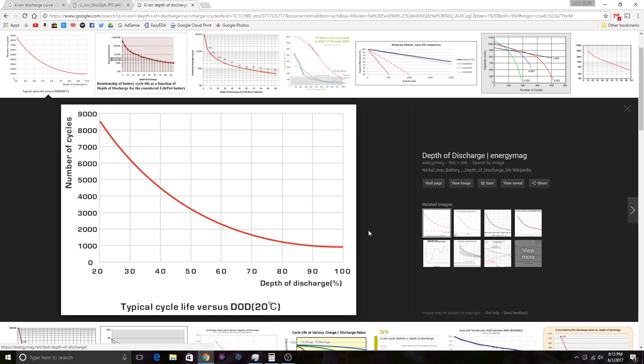Unless you're pulling a really high load off the cells — which is not good for them anyway — somebody actually commented that the cells I was charging in that lithium pack were a lithium iron cobalt mix and would be rated for 2C discharge, which would be about 36 amps. They do hold 30 amps without too much issue, though they get a little bit warm at that current. But like I said, I hardly ever run anything over 100 watts off that thing, and it has served me quite well — still going pretty strong, of course I did just rebuild it. Anyway, this is my thoughts on using a 3S lithium-ion battery pack for a 12-volt lead-acid replacement — it works quite well. That's about it for now, guys. Bye.